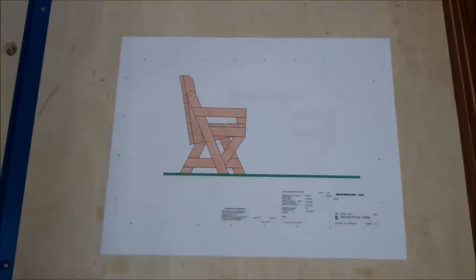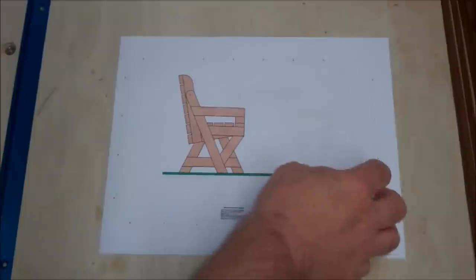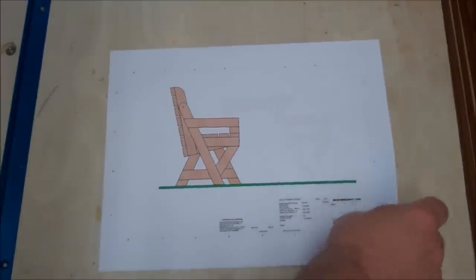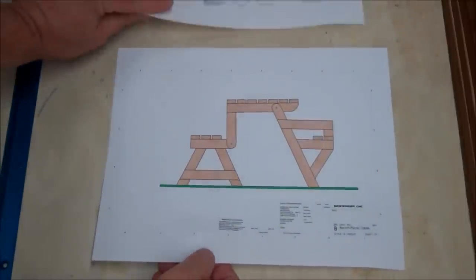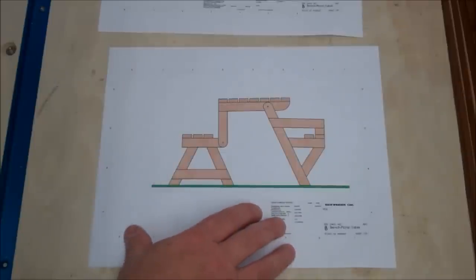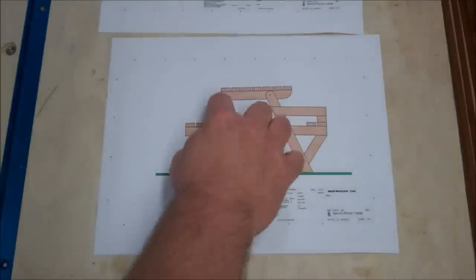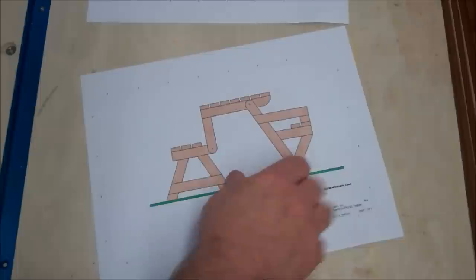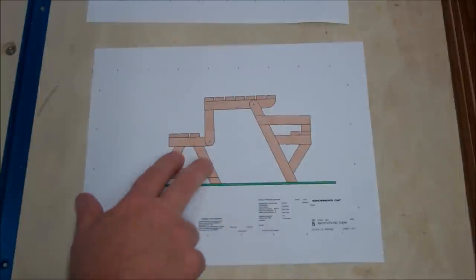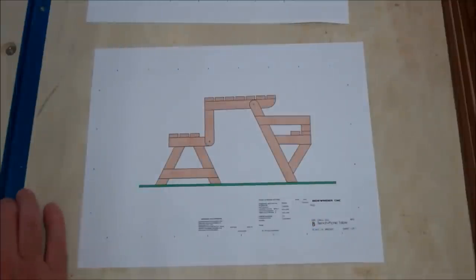As I was looking at this and trying to figure out how I was going to draw this up, at first glance it kind of looks a little complicated. But as I studied it more in the open position where the picnic table is, I realized you just have to break it down into three different sub-assemblies. I've called this seat one, this part here is going to be the table, and then this other part over here would be seat two. If I just break it down and worry about building each section individually, I think it'll be a much easier project instead of thinking of it as one big complicated thing.